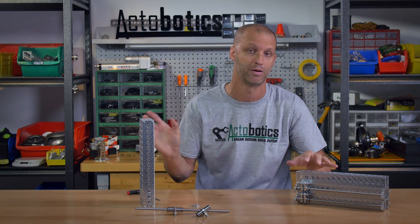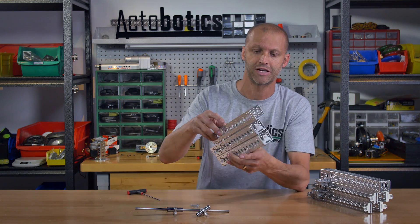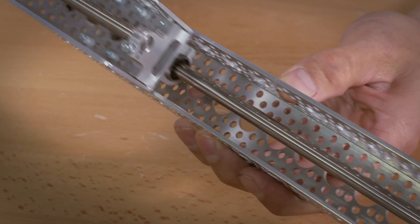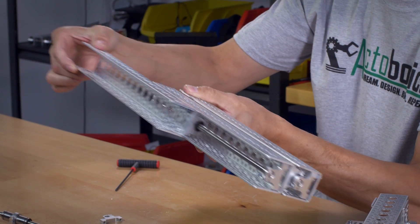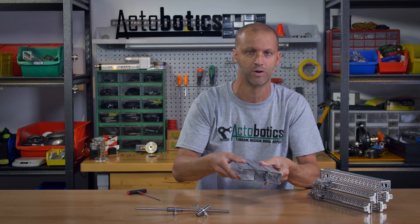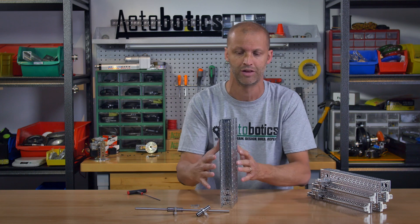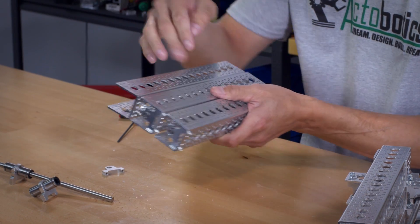So what can you do when you build something utilizing linear slides or linear ball bearings? I've got a couple examples here. This version actually has an 8mm shaft inside. You can build them any different length you want depending on how high you want to go or how far you want to reach out. You can see the linear ball bearings double stacked inside, creating very nice smooth linear motion. When set up inside you're going to get a little bit of wiggle back and forth, but you can stack them so you have one opposing another, and that takes out all the wiggle room — which is an inherent issue when running one or two ball bearings in line.